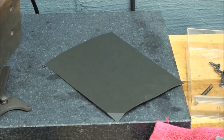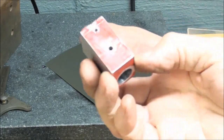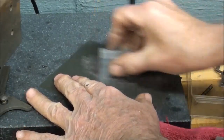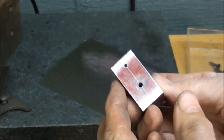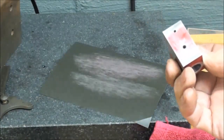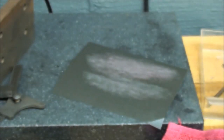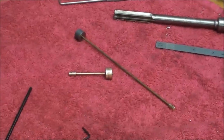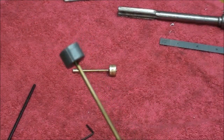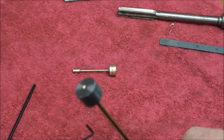What I'm doing now, as I near completion, is using 500-grit Norton wet-or-dry to polish the oscillating surface just a little bit. That'll take the dye off and give me a pretty flat finish. I'm doing this on a perfectly flat surface plate. Then I'm going to Loctite the pivot rod in place and determine the length of the piston rod. I had temporarily put the piston on the end of this shaft to polish it — put on with Loctite, but it'll come right off with my mini torch.